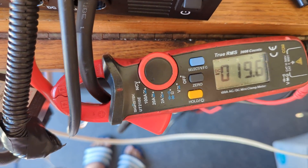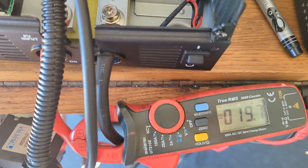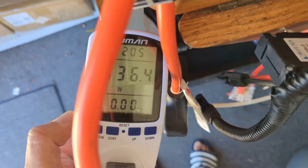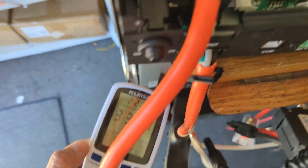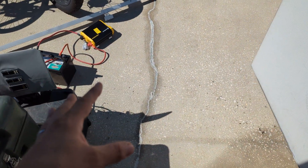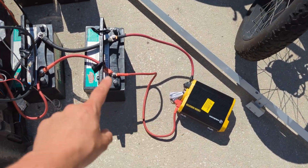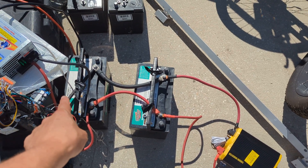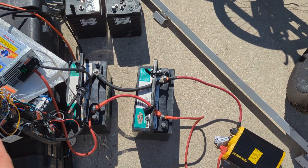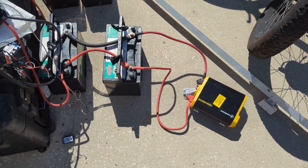Now it's starting to charge. We see that our meter is at 19 amps and our wattage is at 336. So the issue is actually this meter right here — it's not sending out the proper power. We actually have it hooked up to two deep cycle batteries that are currently being charged in boost mode, so there is definitely not an issue with the amp draw on this.